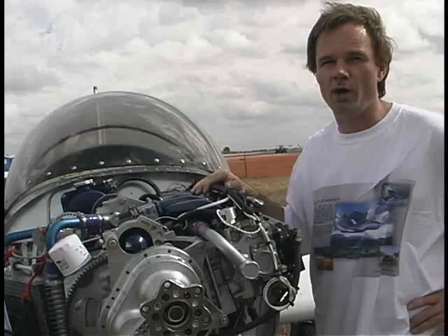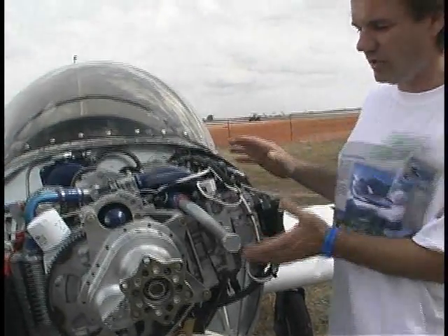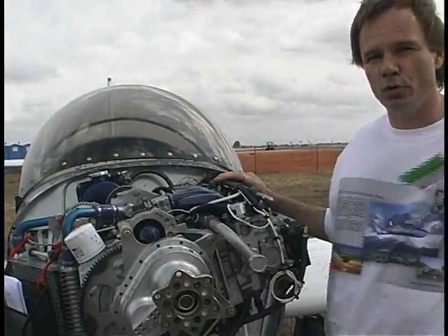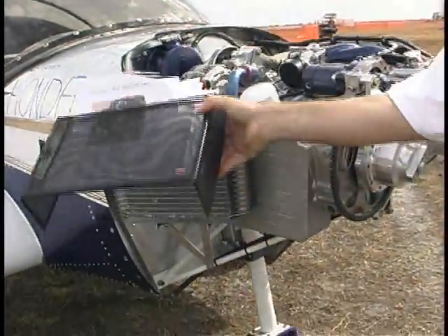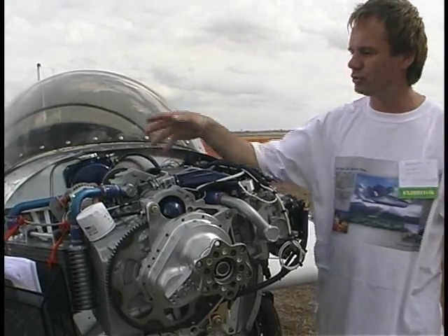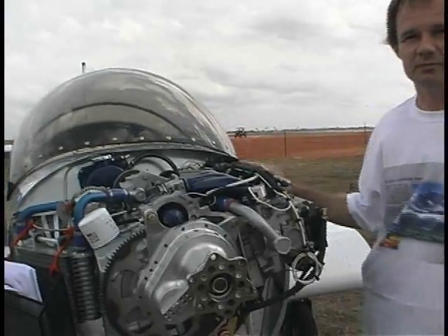It's very important for an auto conversion engine that the cooling system becomes compact, due to the fact that coolant is a weight source in itself at eight pounds per gallon. The cooling passages in the engine were redesigned by Honda and are already very compact. The amount of hoses and tubing external to this engine going over to the radiator is minimal — a very short run out and run in with a small tank for excess cooling and expansion.